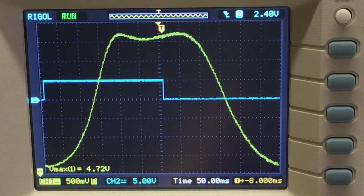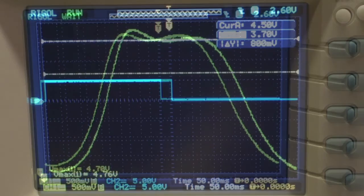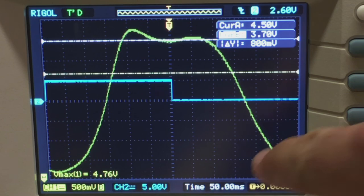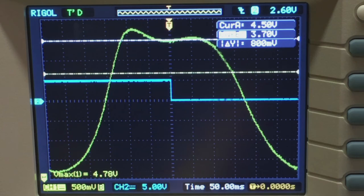slightly off. I think that's as good as it's going to get. So let's have a look and see what we've got here. About there. So what I'm looking at is between that point and that point is my 3 dB point. And I have 30 kilohertz per division. So I've got 1, 2, 3. That's about 80 something kilohertz, and that's about 80 something kilohertz. So I've got about 160 kilohertz bandwidth over there. That's the minus 3 dB points.